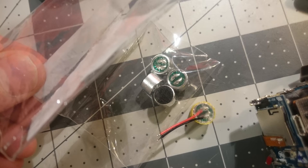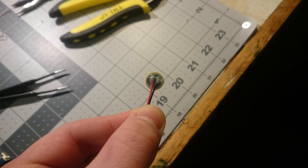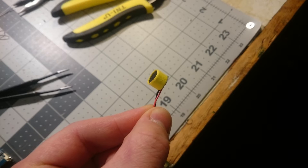I went ahead and bought a pack of maybe 10 or 20 of these miniature microphone pieces off eBay or Alibaba — I'll put a link in the description. They work great. Just a note: the pad on the bottom with the three runoff lines is the negative. I've soldered onto that and put some hot glue over the whole base because when you install it, it touches up against other circuitry on the camera boards. I've also run some heat shrink around the actual microphone since it's metal, just to make sure everything is covered off.